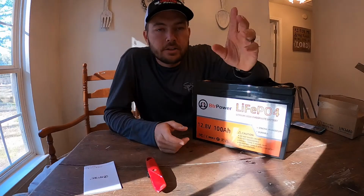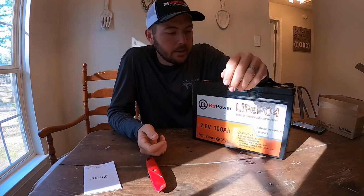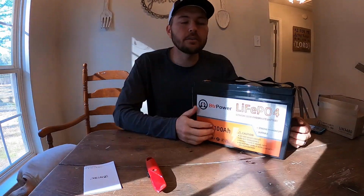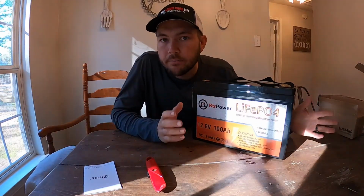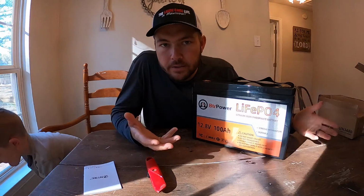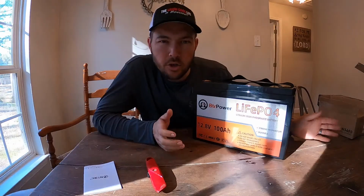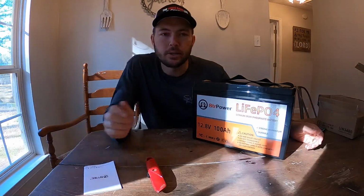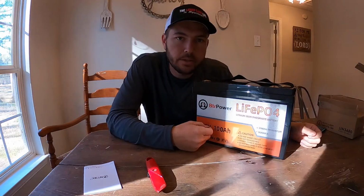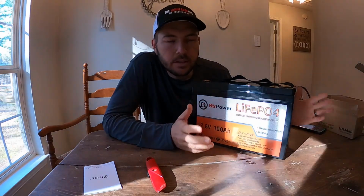And something that I found out, because years ago I tried a regular deep cycle battery, not a LiPo battery, but I tried a 1000 watt inverter. And it turns out that a 1000 watt inverter is always ready to unload that 1000 watts, so it's pulling more out of the battery. So what you want to do, let's say the rapid charger for this Ryobi or my Milwaukee rapid charger, the regular one you plug into the house, I think that one draws max somewhere around 300 watts.